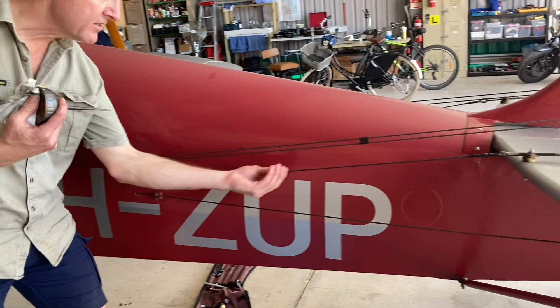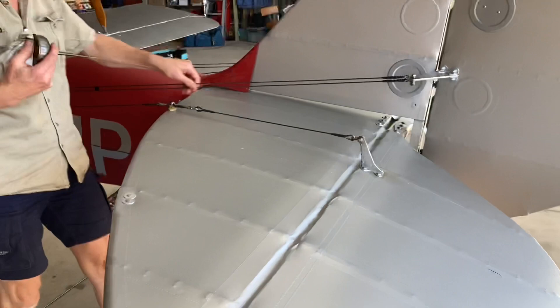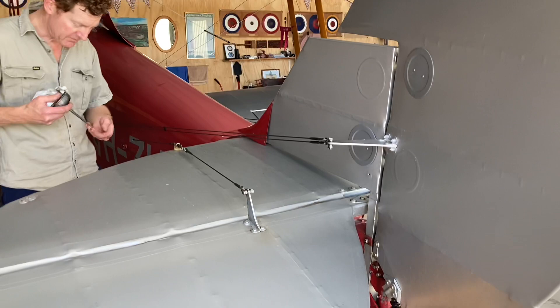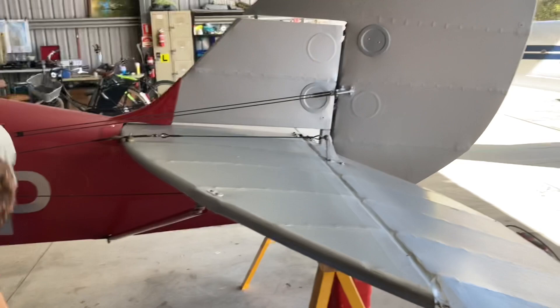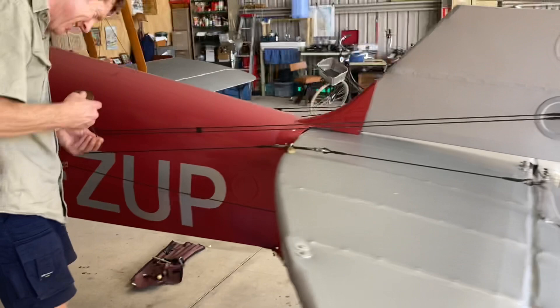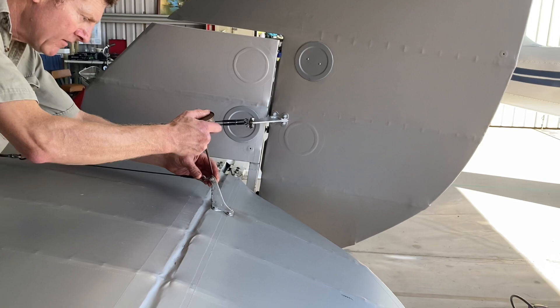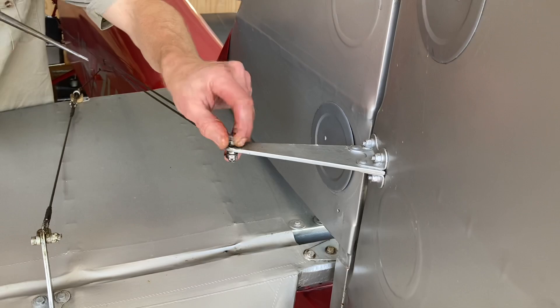There's the ocean, so you get all the sea breeze. I found the best is fresh engine oil — it doesn't blow off; it sticks. The fine oils last about a week, maybe two. They do penetrate easier but they don't stick around, whereas engine oil sticks around for ages and since I've been doing this there's no rust. How long would a cable last? Probably a lifetime, as long as you treat them. If you don't, they'll get rust spots and start splitting.